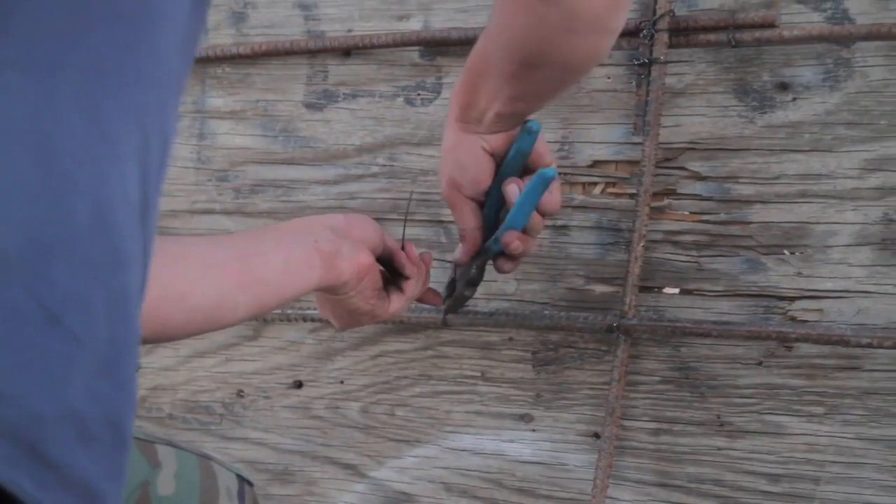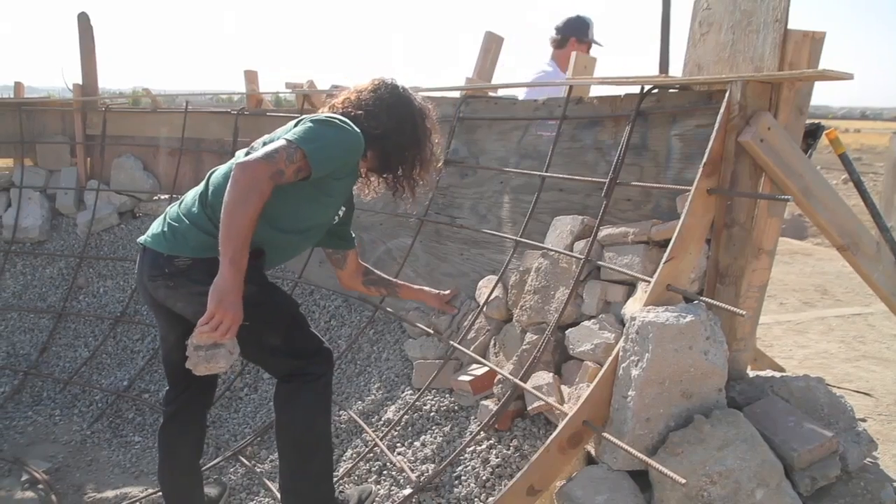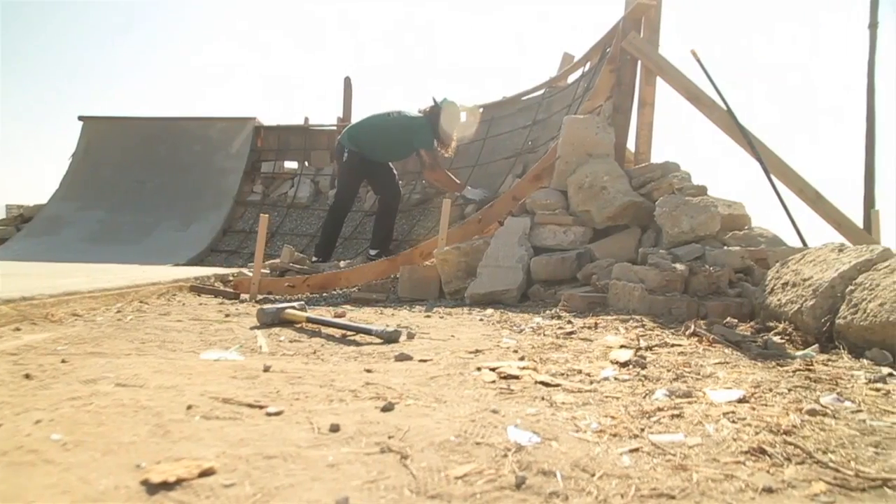So he set it up and we went in and did what I like to call the old stonewall technique — kind of built up the low spots with rocks. We took the rocks and filled in under the rebar, the low spots, making little shelves for the mud to stack on.